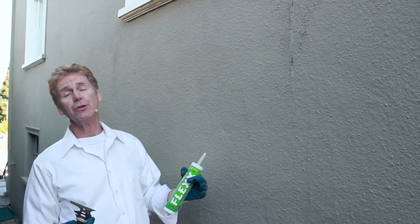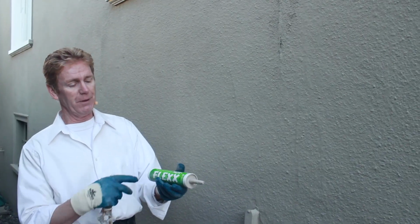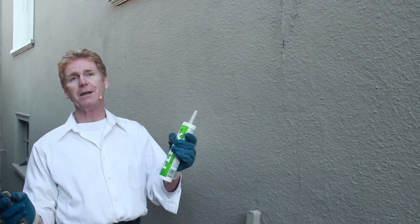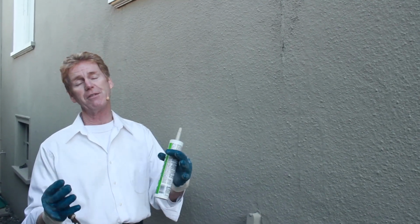Today I just want to show you something about cracking, hairline cracks, and a little bit about bulging. I do a lot of videos, and we recommend certain products like this. It's called Mor-Flexx. It's a caulking with sand in it, guys. And I tell people, if you got cracks, use the caulking. And guys, all the caulkings are made to go usually about 3/8 or less. If you go fatter than that, they'll suck in and you got to do it a second time.